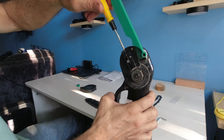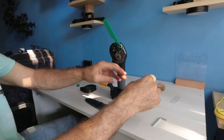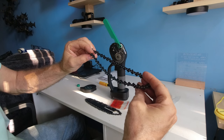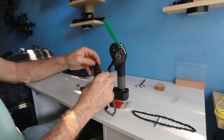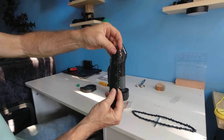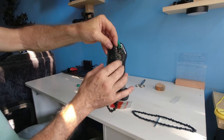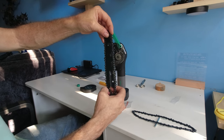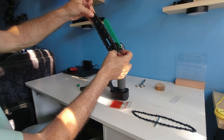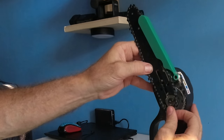When you put everything back together again, for the final touches, you start to tighten. We have a spare chain — I believe it doesn't matter which way they go because they alternate on the cutting pattern. You take it off the guide, put the new one on, and you can come in here and start to grease up the guide if you like. When everything is lined up correctly, you simply hold everything to the bottom, nice and tight, line it up, slide the guide over, and bring it onto the actual gear that runs the unit.